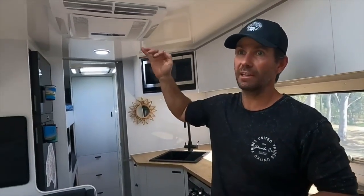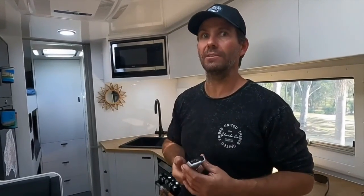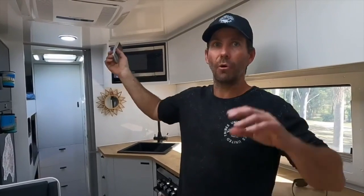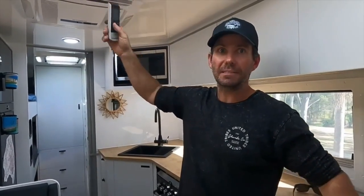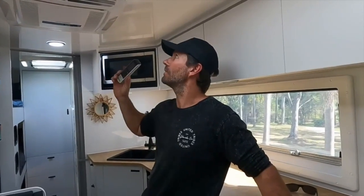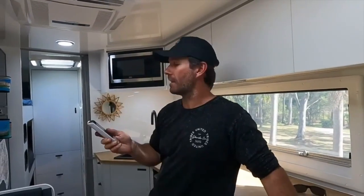Anyway, it fixed it. All he said was, instead of trying to go down and run it at 16, bump your fan speed up and run it at 22. Don't come below 22, and your fan speed on high. Keeps everything running better, more airflow through the whole thing. Your bits up top don't ice up because of the humidity and stuff. And then it worked sweet ever since. We were sure it was cactus, right? But old mate come out, cleaned all the filters, showed us all these tips. So that's a good one for you.